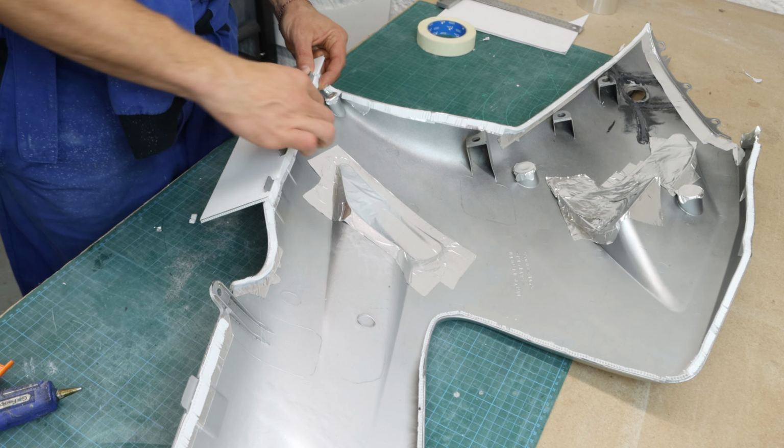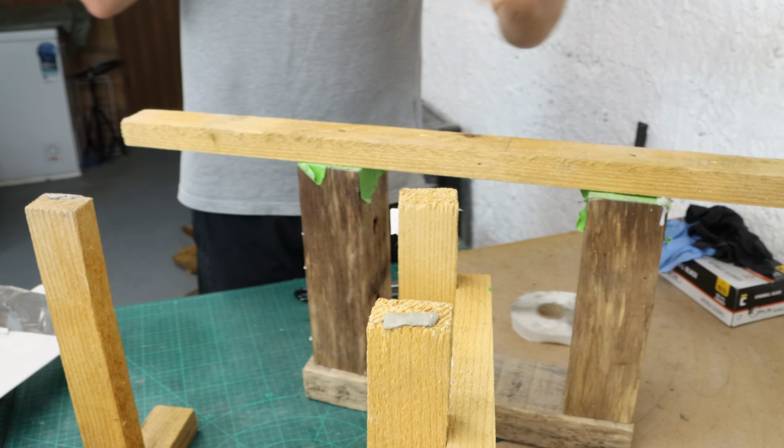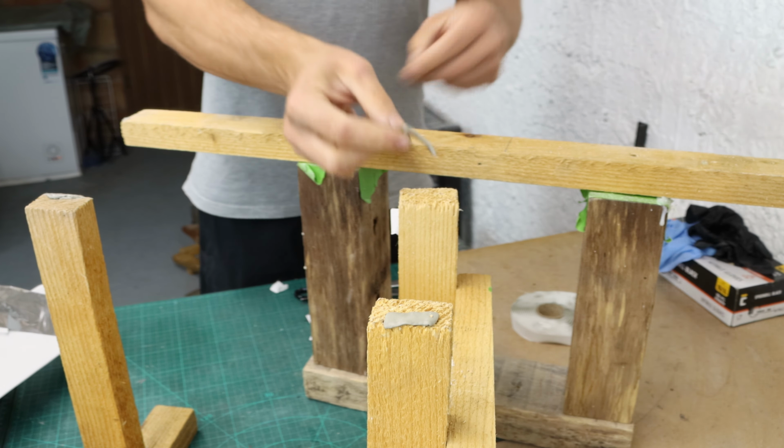I built flanges around the whole part, but I shouldn't have made the flanges for the broken section where the repair was made, because I'll make the two-part mold later. I just got too carried away with the job. I'm setting up a base support to hold the fairing. I used some bagging tape to attach the fairing to the support.